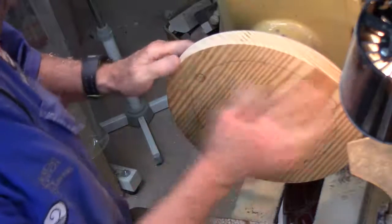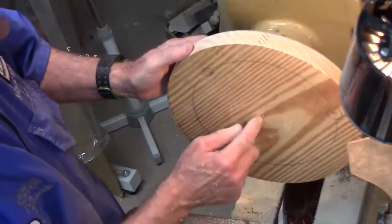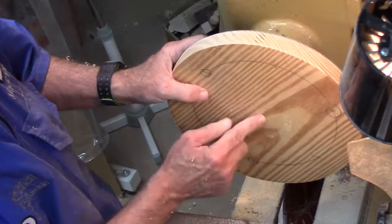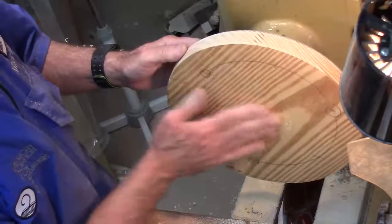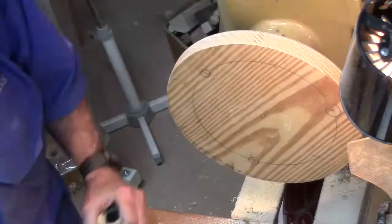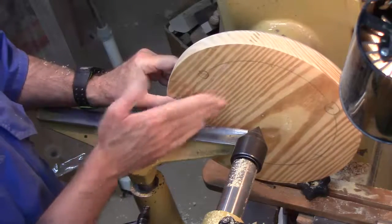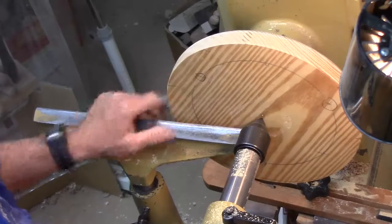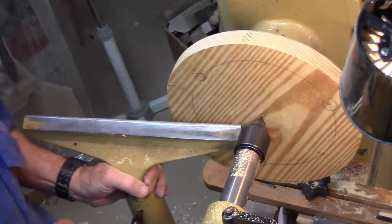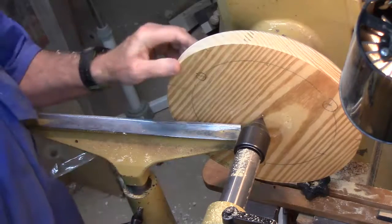And these are some holes. Don't ignore these. I drew this before I started the video. I'm going to give this some tailstock support while we do some dishing, and then I'll remove the tailstock support as we start removing the center. We're going to first taper the edge, then we're going to dish the inside, then we'll finish up the very middle. We're going to dish it down to 3/8 to maybe a half inch. But first, let's round over the edge.